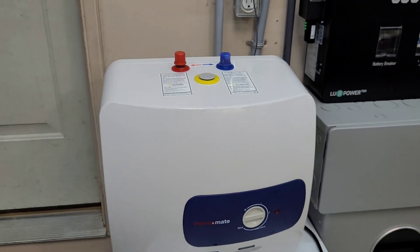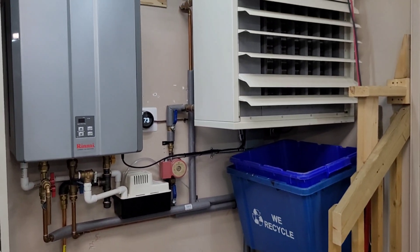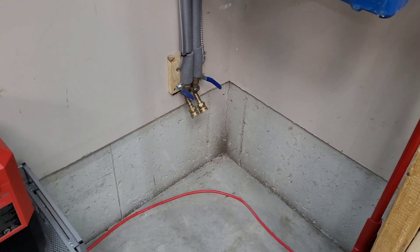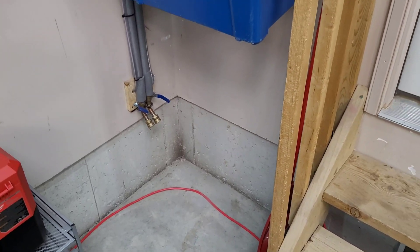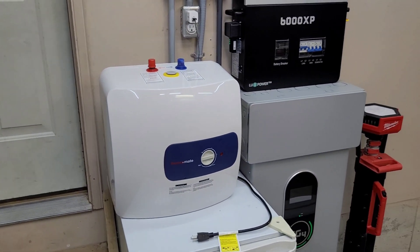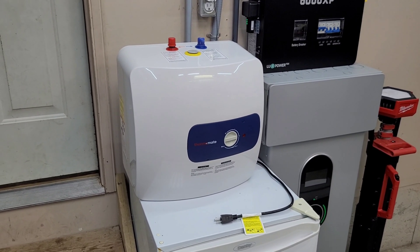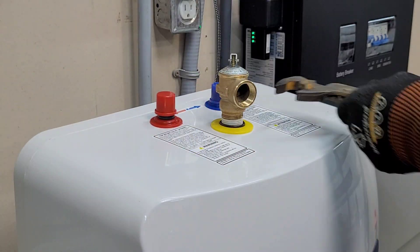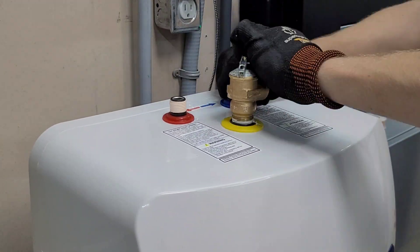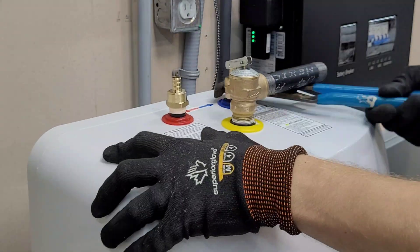This is my garage heater setup. I have a tankless and a hydronic water coil down here, and two service ports I use to flush it and do general maintenance. I'm going to plop it right down here, pex it into the house, and see what kind of use we can get out of it. I think I could get a shower out of this — I'm a pretty quick shower. Laundry, dishwasher, that type of stuff. It's not going to be able to run a bath, but I think for about 90% of daily use you could get away with something like this — even in a tiny house or an RV. I'll get it hooked up, filled with water, fire it up and see how it goes.